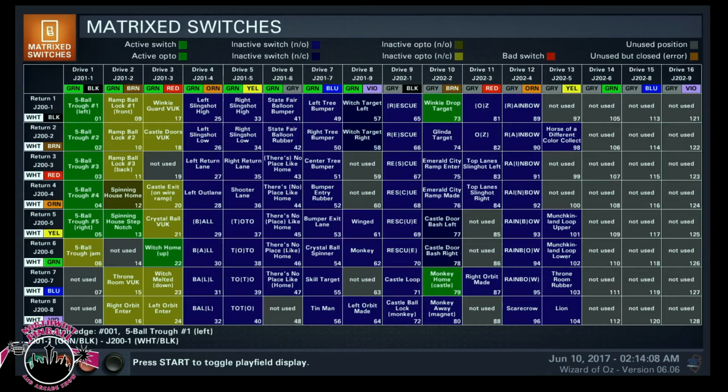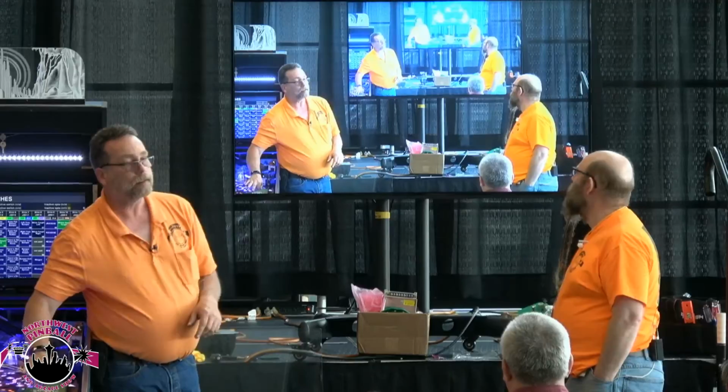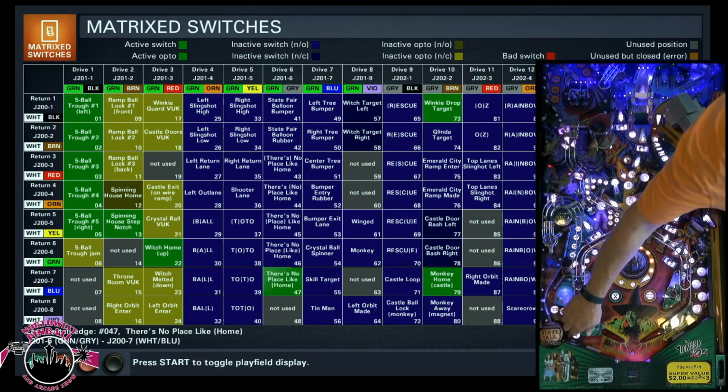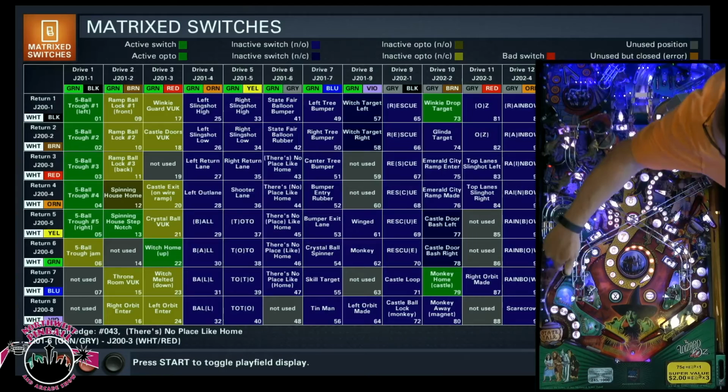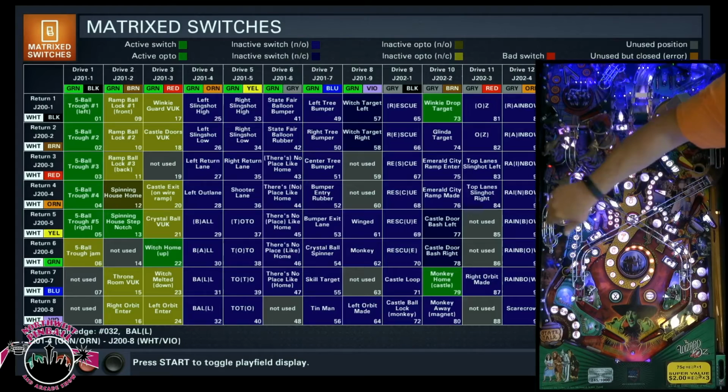And so by pushing any of these buttons, I'm testing switches, and they're changing state. If they're not changing state, the question is why? And it gives you a way to go. One of the things that we found in the $12,000 WAS was that this one didn't work, this one, this one, and a couple over here that I can't get my fingers into. All right. Well, they're all on the same path and they're all part of the same daisy chain.